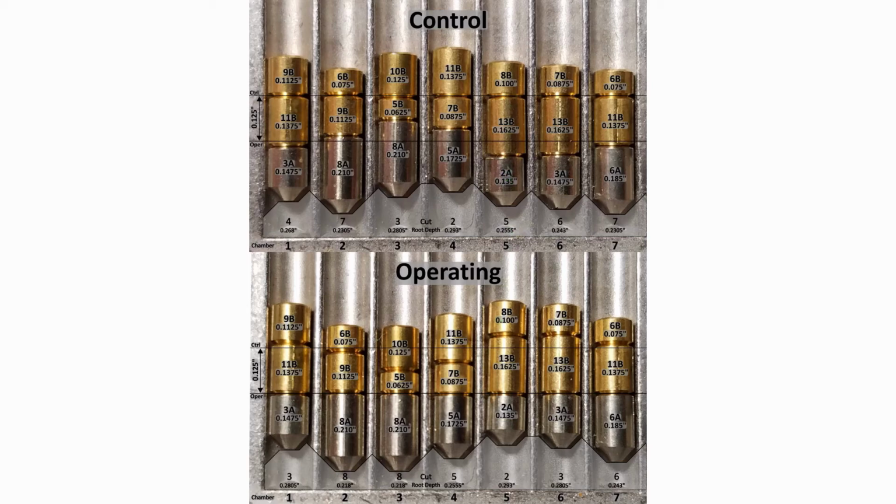Now we're not considering binding order or any of these other factors, like grease and grime in the cylinder making it hard to feel the clicks or anything else. We're just looking at pins. So let's move on to chamber number 4. We start lifting, and, oh wait a minute, what do we hit first here in chamber number 4? We hit the operating shear line first. We have not hit the control shear line. We have to raise the pin higher to hit that.